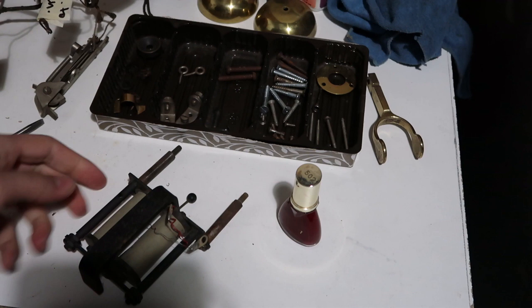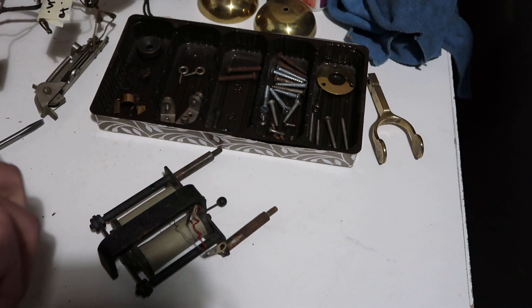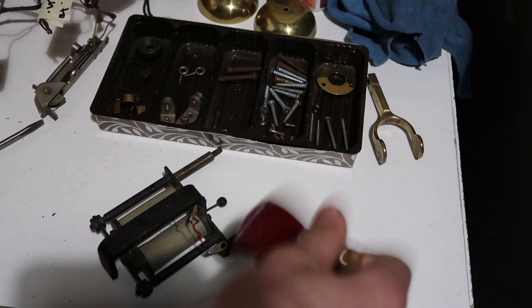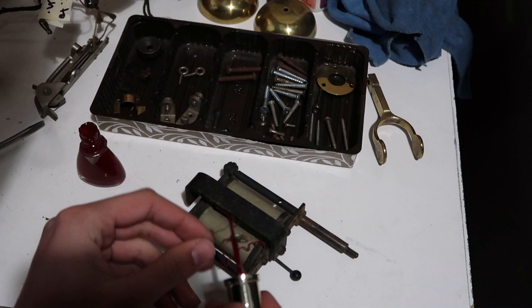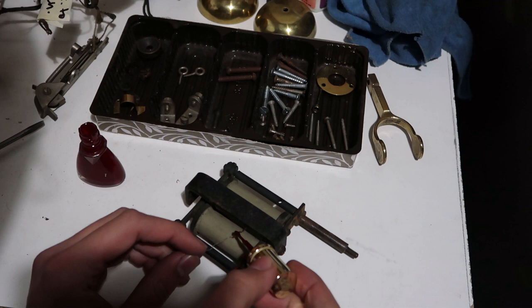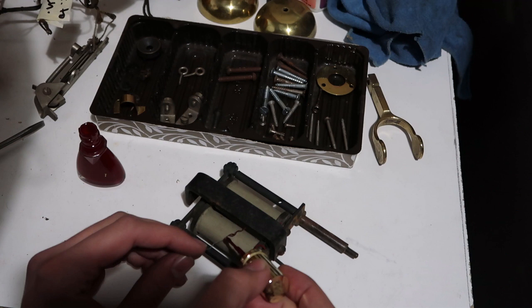Before I install the bells and the ringer, I thought now's probably a good time to use the nail polish to insulate the wire while I still can get to it. Actually, first, give it a good shake. Handy that this one happened to be the right colour. Well, red. Let's see if I can do it without making a huge mess. But yeah, it's a little sticky. Sort of like enamelling the wire.